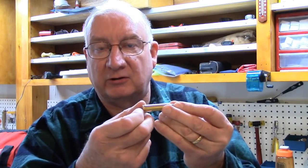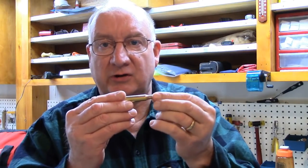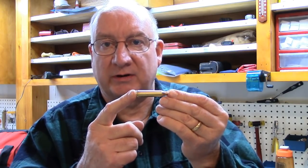And you say, well, why does that occur? Very simply, because sometimes you can have a burr on the back of the cartridge base, on the head of the cartridge, that's barely noticeable. Maybe just simply a raised up burr from your extractor from the last time you fired the case, especially with autos with forceful cycling. It can be something as simple as that. It can be a situation where, because of that, maybe it's canting the cartridge to one side. So all sorts of things can happen where you don't want to be that close to the rifling.